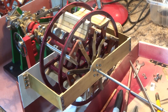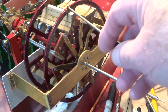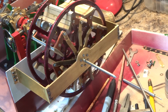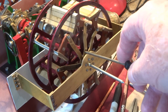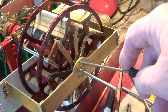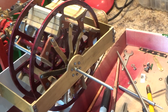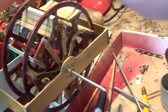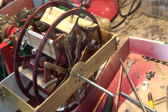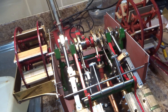This is the first trial fit of a sponson for the left-hand paddle, because if it was a boat it would go that way. I've got a few interference problems. There's a bit of binding on some of these linkages which I've got to look at. I don't think I've got enough clearance between the gear that works the paddle and the sponson, so I've got to have a look at that. As you rotate the wheel, the whole lot goes on the move, which is a sign that something's clunking into something else that really didn't ought to. Progress of a sort.